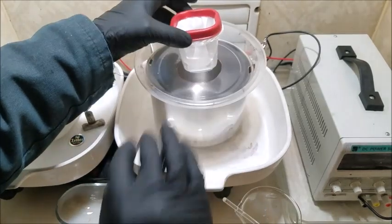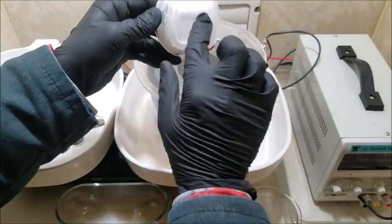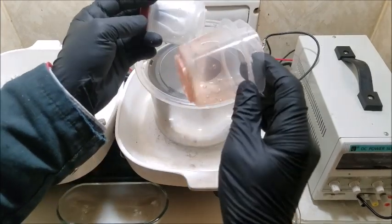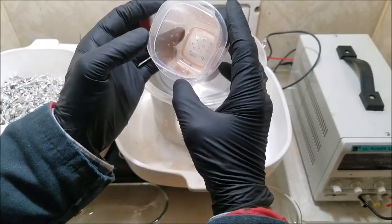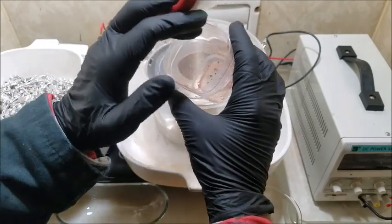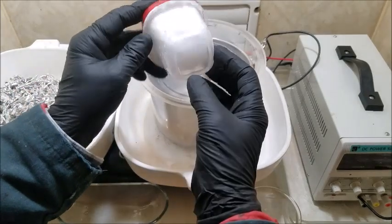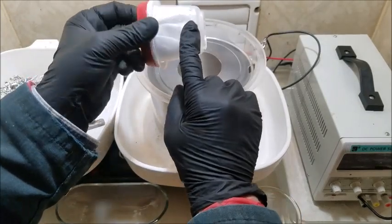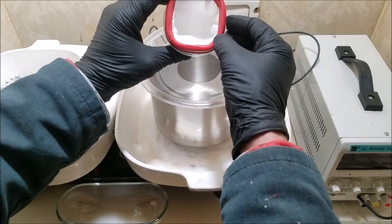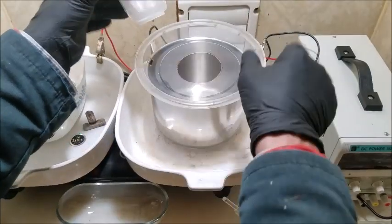But yeah, well, let's see. You can see this little basket. One modification that I changed is I didn't drill any holes in the bottom. Here's the one I used last time. I have the holes all in the bottom so the fluid can get in there. However, as you can see, there's some coloration there. Some fine sediment does work its way through the filter, and it settles in the bottom. And when I pull it out, it kind of flushes itself out. So one modification I want to try is I just put the holes here, nothing in the bottom. So whatever does settle will hopefully remain there, and hopefully the filter will catch it all. But if it doesn't, it's going to remain there for the most part and not pour into our solution.